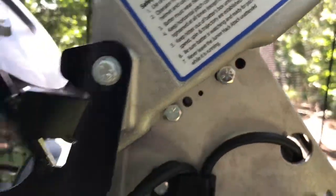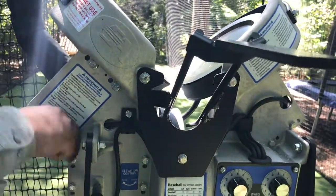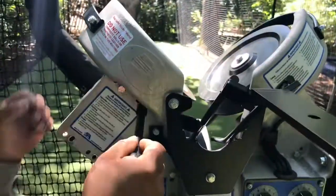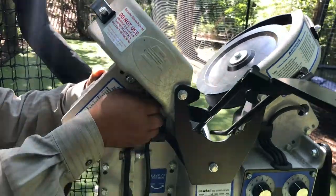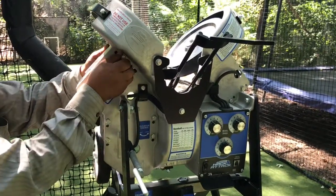The whole process is moving the two top motors up and the bottom motor moving in there — that will give you the opening for the softball. We'll have to take down and replace the shoe, taking off the three bolts, 7/16, to take down the shoe, so that way we get the top section ready between the wheels for the big softball size.